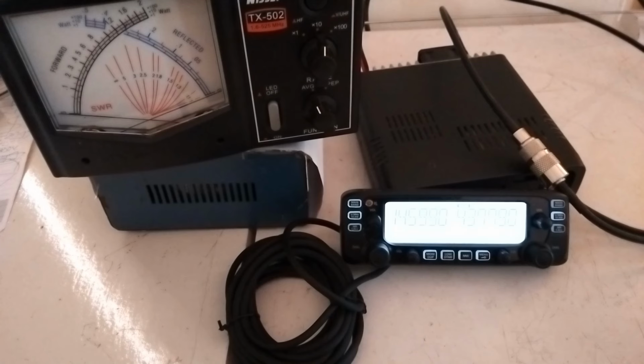I am happy that overall SWR is good in the VHF band, and even on the UHF band it is reasonable, though I am not planning to transmit on UHF because the International Space Station needs only reception on UHF. The next step will be to test reception during net timings for VHF and possibly listening to some passes of the International Space Station which are of high elevation, which I presume could be picked up at least partly with this delta loop antenna.